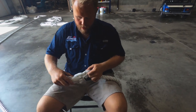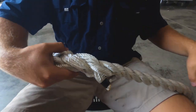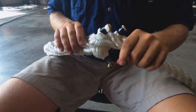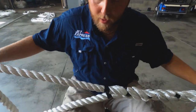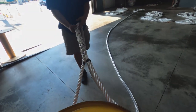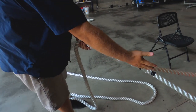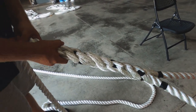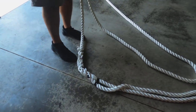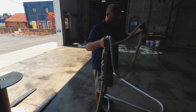We're almost to the end here — going to put our last couple pieces in. Typically you're going to have some of these ends hanging out, and that's perfectly normal. Then what I like to do is put it on something solid — this barrel here works good. Put it around and give it a little bit of a tug, make sure everything's falling how it should. When you stretch it out you can see how the lines come together real nice at our tape marks and the braids filter in. If your braids aren't sitting too good, you can put it on the floor and roll it around a little with your foot and things will fall into place. That's how you splice a line here at the Jet Express. We'll see you on board.